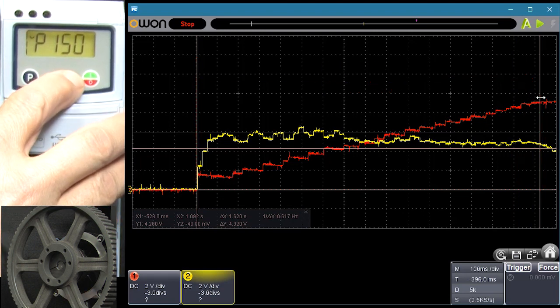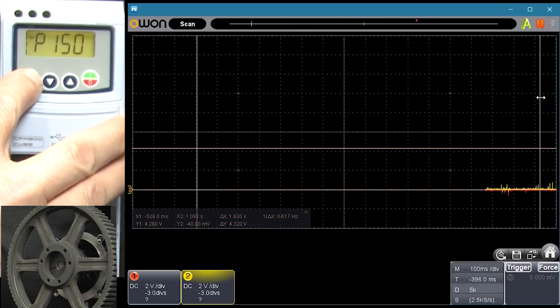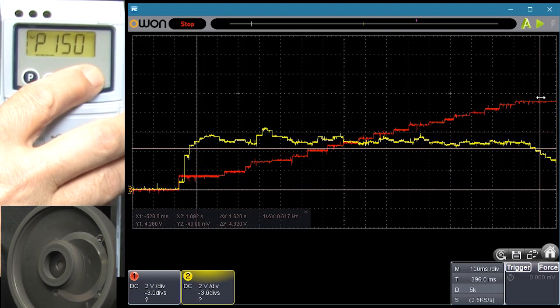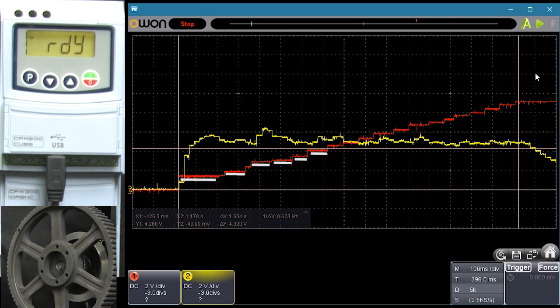Let's go to parameter 150 and switch from ramp decel to ramp hold mode by putting a 2 here. Start the scope, hit run, stop. We got pretty much the same ramp time, but this time instead of decelerating the ramp to limit the current draw, it was simply held level — exactly what we wanted. And again, while the analog output is too coarse to see the actual threshold crossings, we can definitely see the ramp hold periods and that the current was held at a reasonable level.